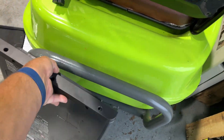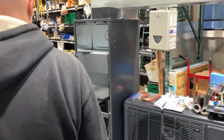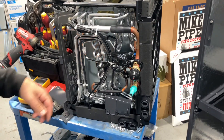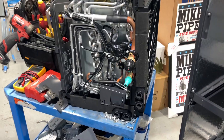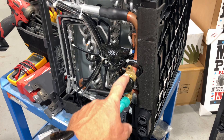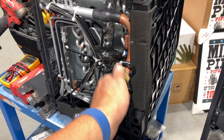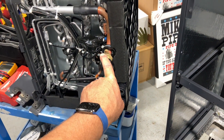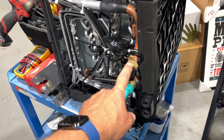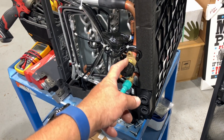We basically disassembled the entire air handler. Let's take a look at the evaporator coil — what I love is we have flare connections on all of our line set connections, both at the evaporator coil and the condensing unit outside. They give us the adapters so you don't have to flare while you're on site, and this allows you to possibly use ZoomLock during the entire installation.